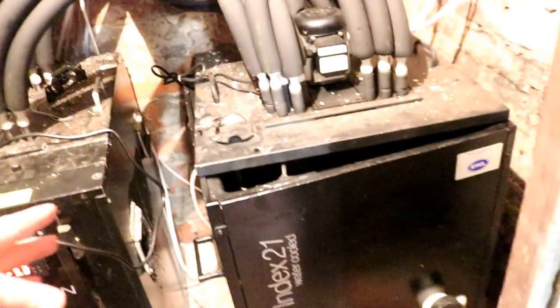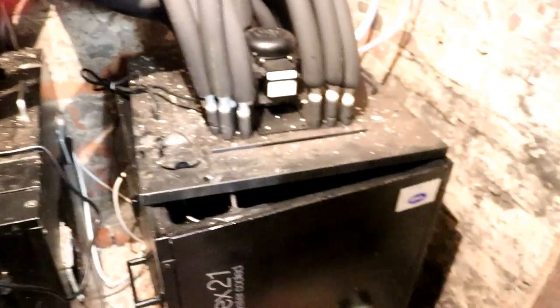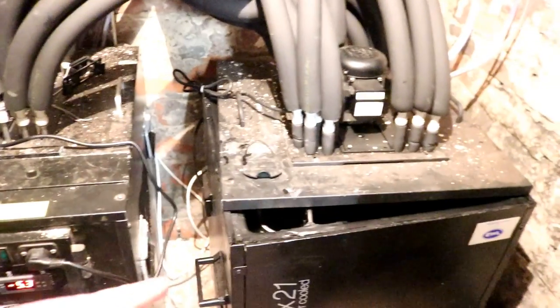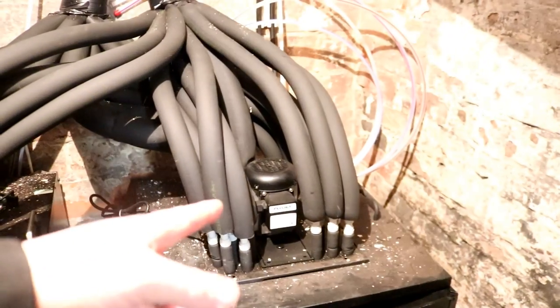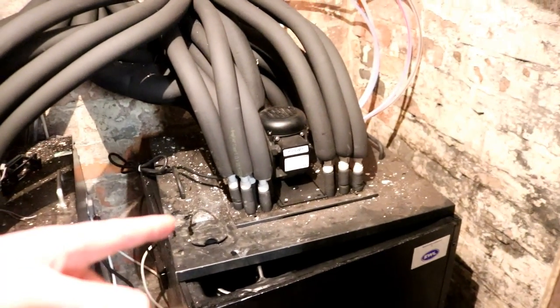Right, I've had a quick look at it. No ice bank - it's warm. Something's gone wrong on that machine which was bought from EWL, so there should be a warranty on that. We've not had it running for six months. I'll take the front off and have a look. The recirculating flow jet pump's working, the green light's on. I'm guessing the stat's gone. It doesn't seem to be any pressure and there's no continuity between these two contacts. Because I haven't really got time to get into the gubbins of this whole shebang, what I'm going to do is just wire up an STC in line and plug it into the socket up there - hopefully that'll sort us out for the weekend.